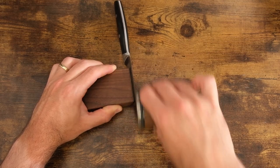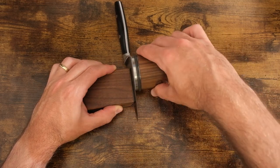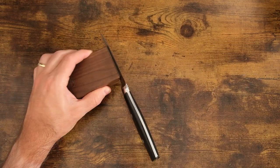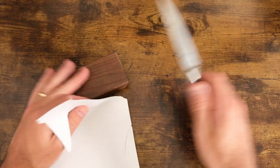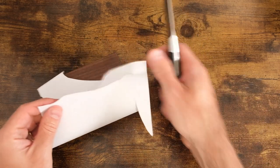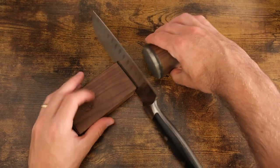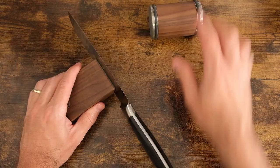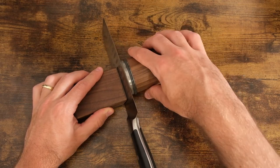I'm only doing this for 10-15 seconds here so you can see that these knives do get really sharp. Flip it over one more time to move that burr back to the middle, then test for sharpness — pretty sharp. For thicker blades that are too tall for the grinder, where it doesn't reach the top of the blade, you'll need to set this on a cutting board or block to raise it and be able to reach the top of the blade.